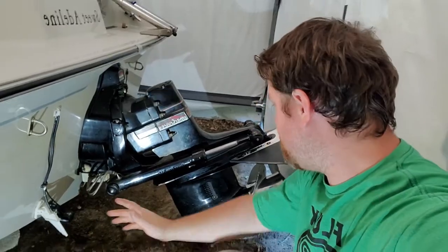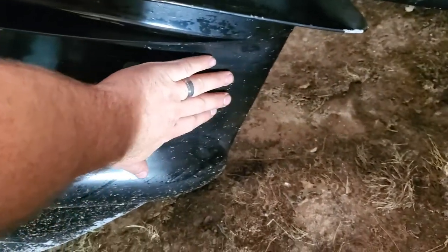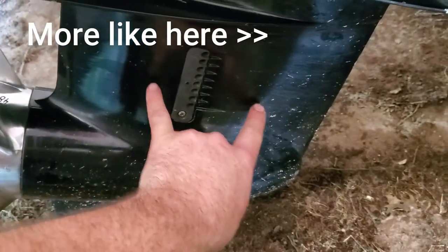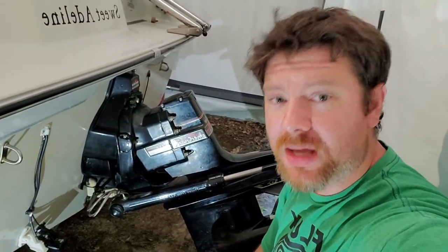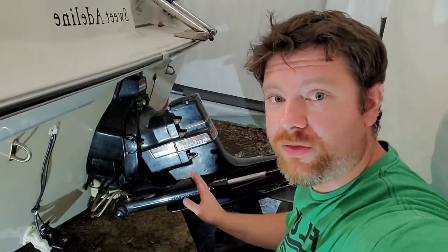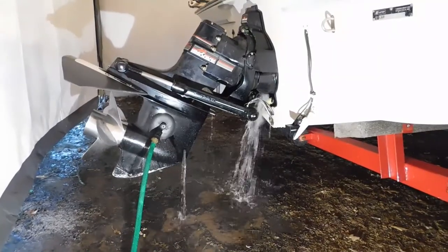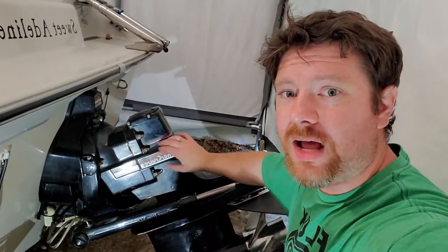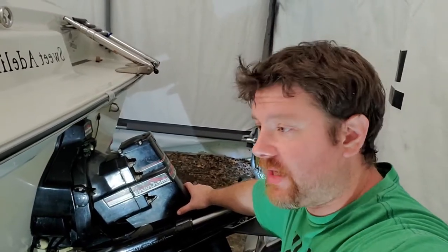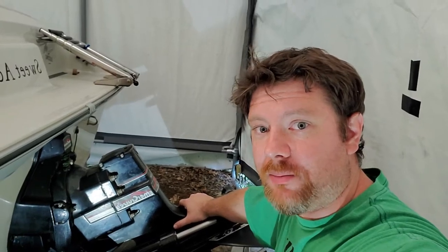Why would a boat overheat if all the parts are new? One reason it may overheat is because of the inlet — your water comes across your out drive and goes into these fins, but your impeller is located in this area and that's what's pushing the water up. One thing that will immediately burn out an impeller is if you start the boat without the water muffs on. Without those muffs, it's just rubber on metal contact inside there, and it's going to burn up and melt, causing it not to work properly when you go out on the lake. So if you ever did that, that's the first thing to check — even if you just replaced it, tear it back apart and check.